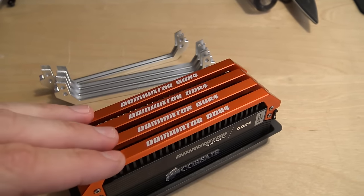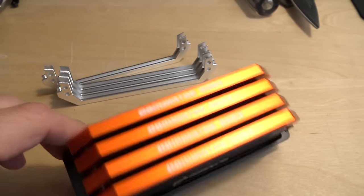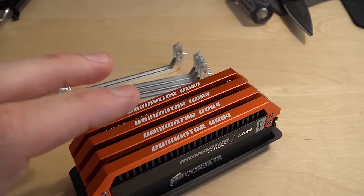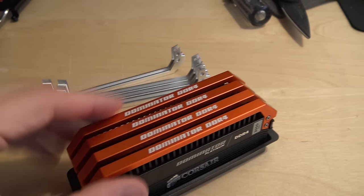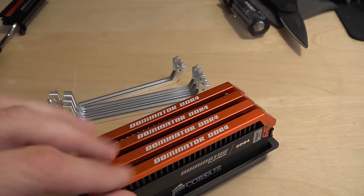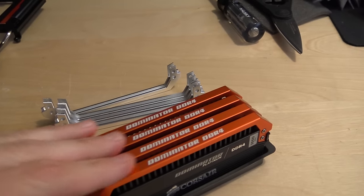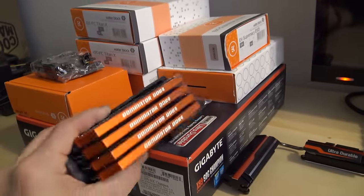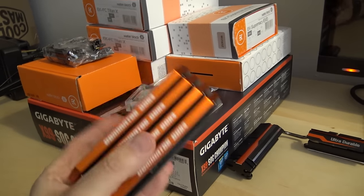I mean, these are aluminum or aluminium, depending on which country you're from. Then you guys would know aluminum, when you anodize it, you basically put it in a chemical bath, the pores open up, it absorbs the dye, and then the metal itself becomes that color. It doesn't flake off, it doesn't scratch off or chip. Actually strengthens the aluminum as well. So I like anodizing when you can, and it's actually a pretty good color match to all the other orange I'm going to be using. So yeah, there's that. Let's go and look at the motherboard.